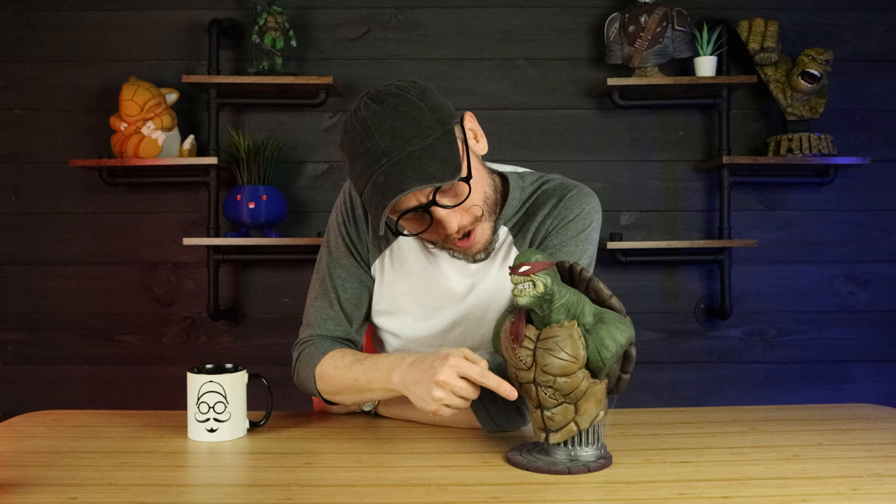Let's talk about the very first issue, and that is isolated towers — or isolated tree trunks. You have one support structure going all the way up, it's pretty high, it's all by itself. For example, if you're printing a model with a chin support coming all the way up, while you're printing it might keep breaking off, maybe because it keeps wobbling.